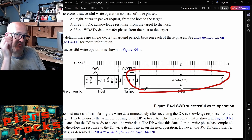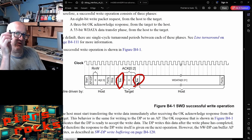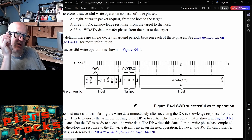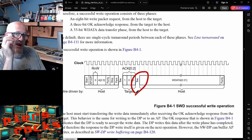Then there's the actual data transmission phase. In this write operation, data is being sent from the host to the target. There's also a read operation where data comes back in the other direction. You may also notice these funny TRN elements that are one clock cycle long — that's short for turnaround. This is to allow control of the data line to move from the host to the target and back again. The command is being sent by the host, but the acknowledgement is being sent by the target, so the turnaround time allows the host to relinquish control of the data line and the target to take that over. You'll see another turnaround after the acknowledgement, because in this case the host needs control back again to actually write the data to the target.